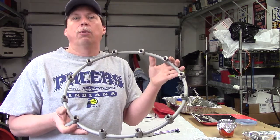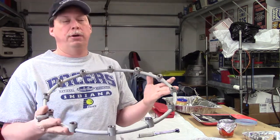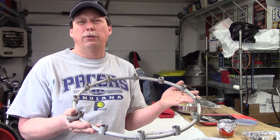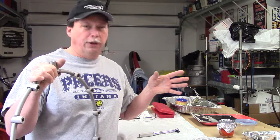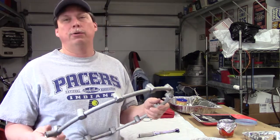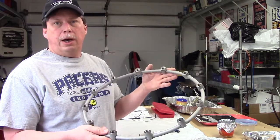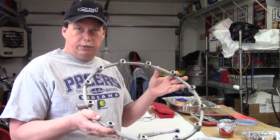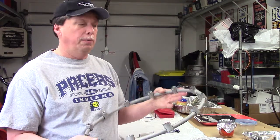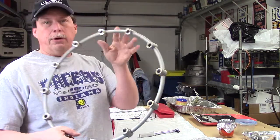If all goes well and the nozzles work good, we'll use them. The only way to really test them is under pressure and then observe the spray pattern. You can look at Agent Jay-Z's channel — they have a video where they actually have a plexiglass or clear acrylic enclosure and pump fuel through the nozzles to see the spray pattern. I don't want to spend time building a contraption; a buddy of mine has a connection with a shop that repairs injectors and can test them at different pressures, so we'll have it checked out by him.